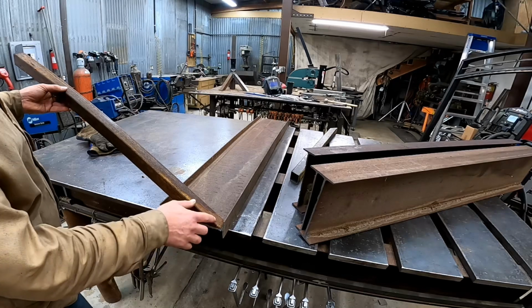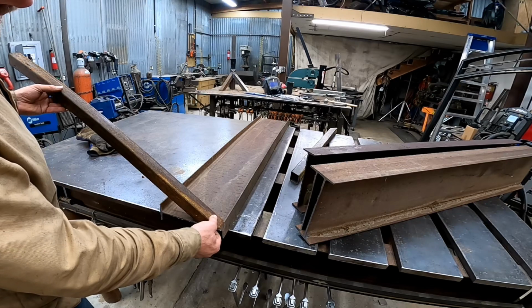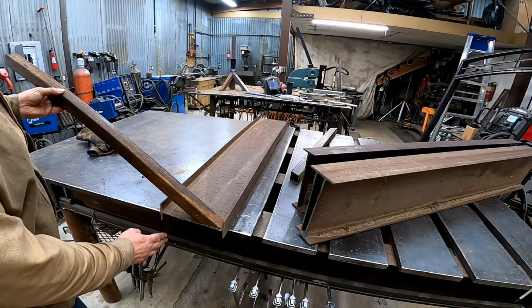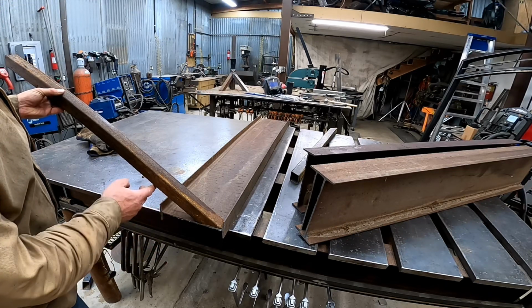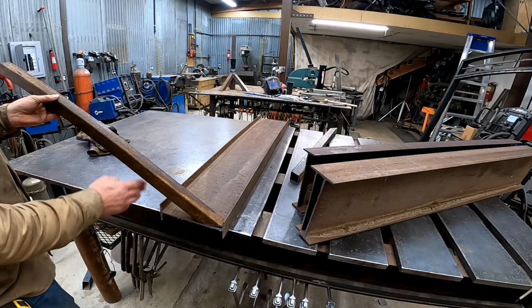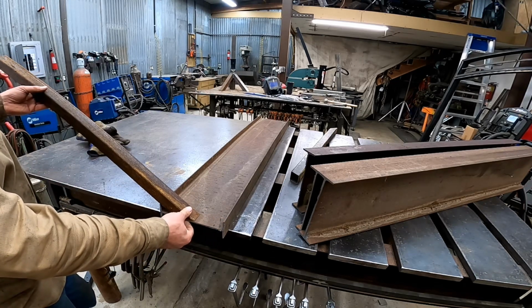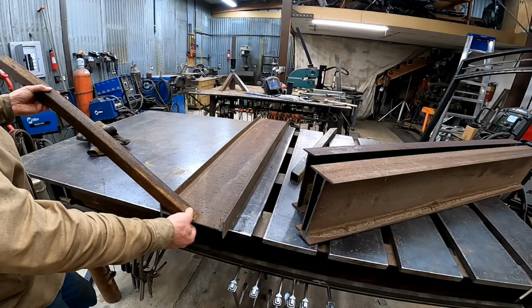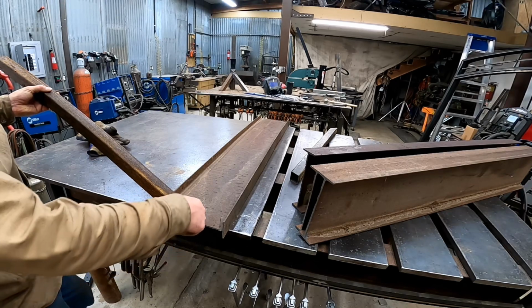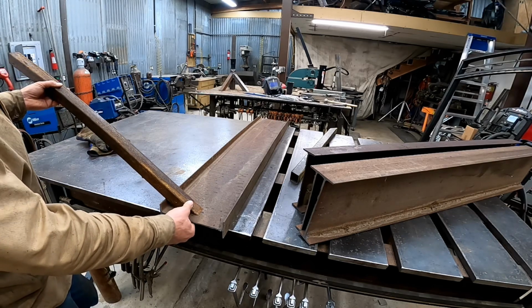So if I do go ahead and put this leg right up and underneath that flange, what I can do is I can come through here with a cross support right on the bottom of that lower flange, and I can hit both these legs. Otherwise what I can do is I can come further down with the cross support and maybe hit. This isn't a bad layout either because I can weld here as well as 3 sides of that leg, especially if I hold back about 1 inch.